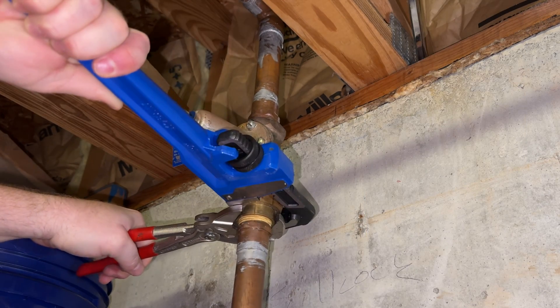I think we found the culprit to what's making the sound right here. I think this eroded gasket caused turbulence in the water as it went through and under the right flow rate made that swish swish swish sound — that's just my theory. Go ahead and put your comments on what you think it is. As for the reason why it wasn't reducing the pressure, it would have to be this gasket right here — it's the only gatekeeper that separates the two water pressures. I've spent several hours researching this because I'm very curious on how it works and I'm about 97% sure I'm accurate, but there's no real good videos or literature that I could find that explained all of this.